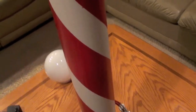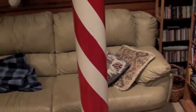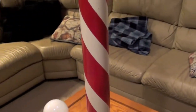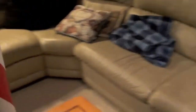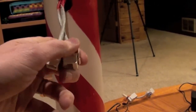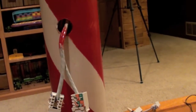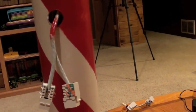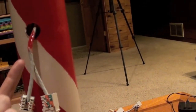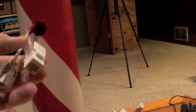This is controlled by a DMX controller inside the pole — it's one of the three-channel LED DMX controllers. You can get them through CheapDMX.com or through Ray Wu's store. That's connected down here to two Cat5 jacks. This is temporary — the final model will have a surface mount jack pointing straight down to keep the weather out, with caulking on top to seal everything up so water sheds off to the side, and Cat5 cords plug in below.